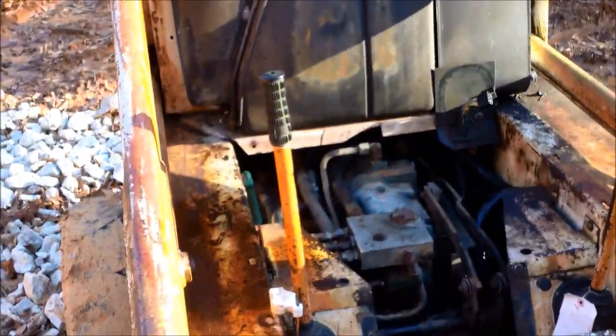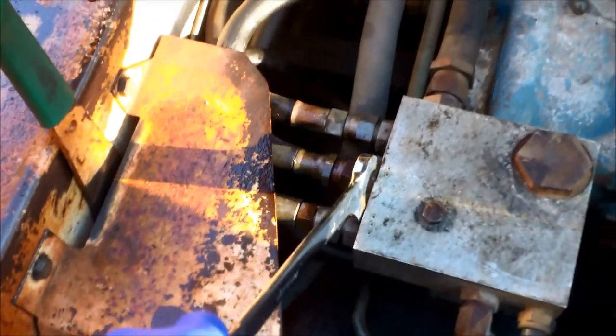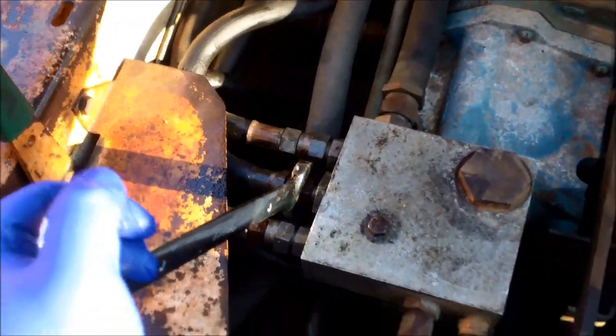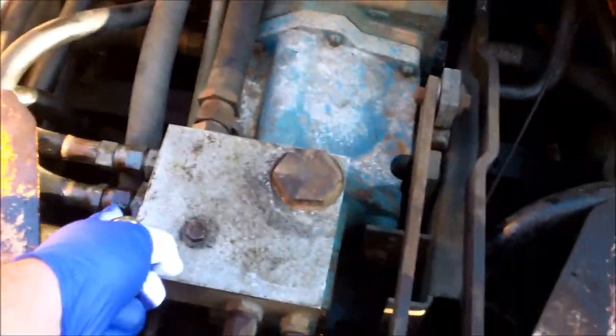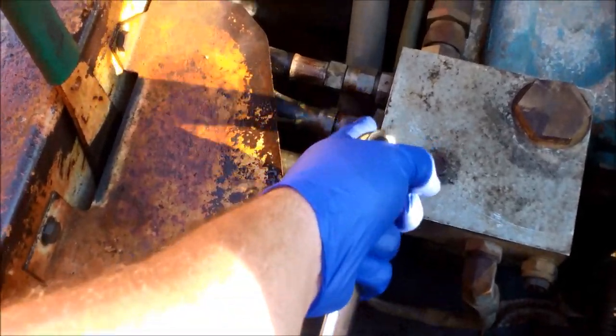Here's the cab — let's tilt it back and get in there. Get your one inch wrench. Right here behind this nipple or fitting, there is the filter. You're going to take this, get all this line loose, and then this fitting right here is an inch and a half.